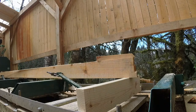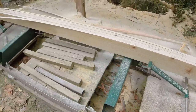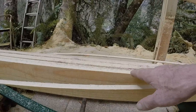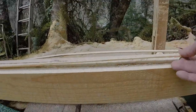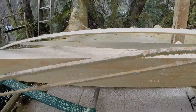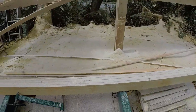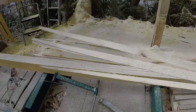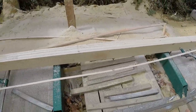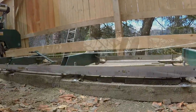I don't know how you ever catch up with this tension in the wood. Did not touch the saw height. We'd cut that level once, but when I came back again just now, it had humped up some more because of the release of tension from cutting those strips off over there. Now we got these strips off over here. If I ran that saw down there again, I'd probably shave off a little more. But we'll quit right there, flip them over, and cut the high ends.